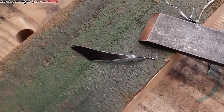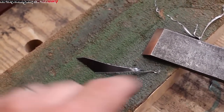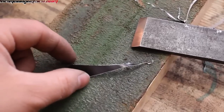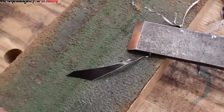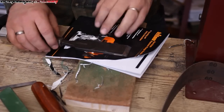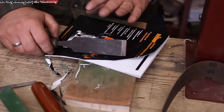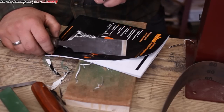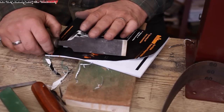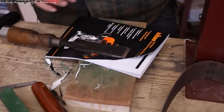That there — what is that? This should now — that is razor sharp. And here is the perfect example of what we're talking about. This piece of card or paper — that edge was cut after we honed the blade. That rough edge was cut after still the 3000 grit, but after using the 3000 grit belt on the sander. It took a little bit longer than it could have because we've been using the Pro Edge, and it does take 20 or 30 seconds to change the belts. However, if I was doing 10 or 15 chisels, I could do all of them inside of an hour at this level, whereas doing it by hand with waterstones is a much longer prospect.